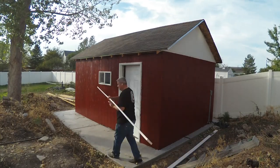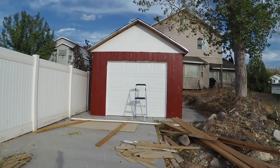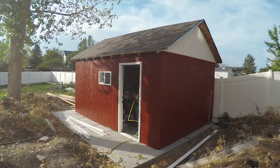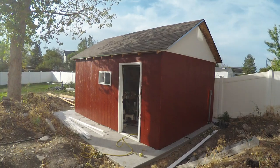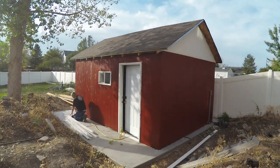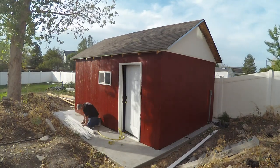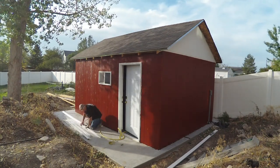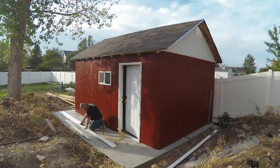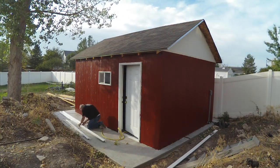I have these 12-foot polypropylene boards that will cover the transition from red to white, and a bunch of 8-foot boards made out of the same material as the siding for the corners. These I painted white with the same semi-gloss paint as the ends. I nailed them together to form a corner, and put silicone caulking down the insides of the seam.